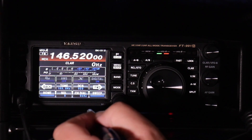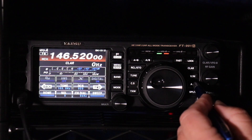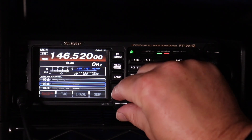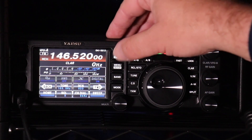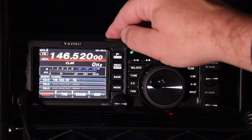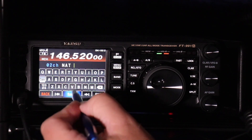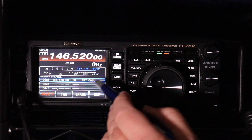You won't have to worry about the actual PL tone since you already turned it off. Once that's all set, hit the A-M button. Choose the memory slot you want — we want slot 2. Press and hold the A-M button. Then press the Function key again and hold it. Bring it back up and you can see that you're locked in. To put a tag, hit Tag, enter the tag you want. Since it's the national calling frequency, we'll do NAT Call. Hit Enter, and you can see you've got a tag in there.